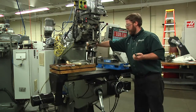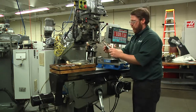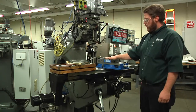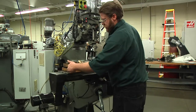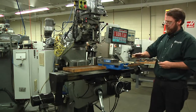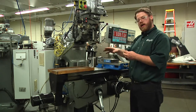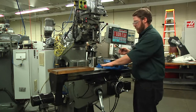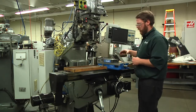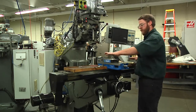The tools are almost always stored on the side of the machine. The cutting tools will be in a drawer over there in their proper location, and the collets should be on the machine — every machine should have a full set of collets. When the vise is on the table, one thing we like to do is use these tool boards. We put the tool boards on the table to protect the table. These cutting tools are designed to cut metal, so if you set them on the table or vise you're actually compromising the integrity of that surface. So you want to use a tool board. Put your tools — even hammers, files, wrenches, everything — on a tool board. We want to keep this table as nice as we can.